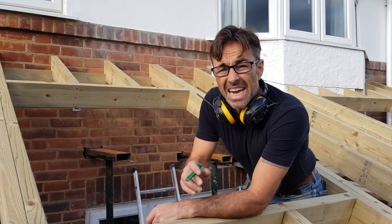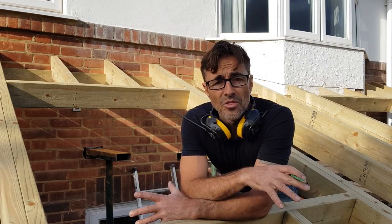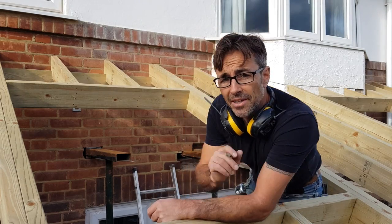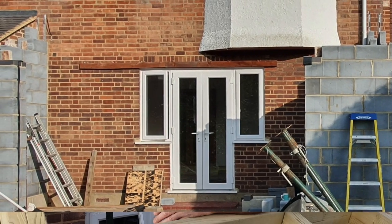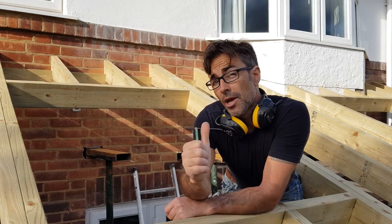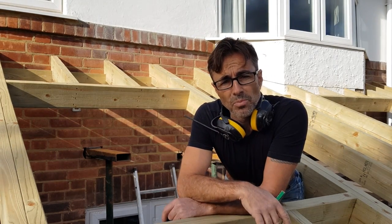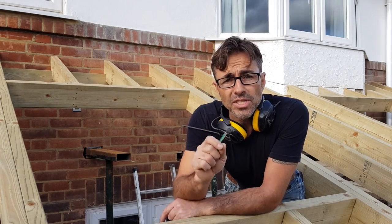This is a relatively small beam, around about five meters long, but it's carrying the back wall of the house which in turn is carrying the floors upstairs, the internal partitions, and the roof loads over the top. When you add all that up there's a fair bit of weight and force. This particular knock-through is made a little bit different because we've got a bay here which effectively breaks the masonry and creates a really big point load right in the middle of where we need to support.